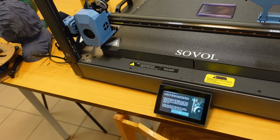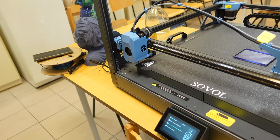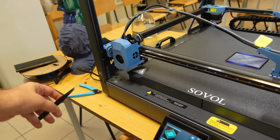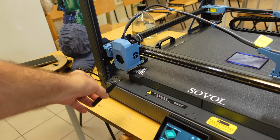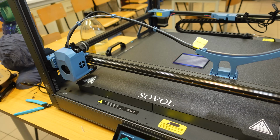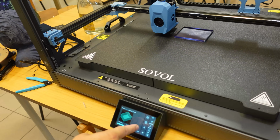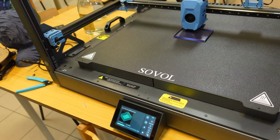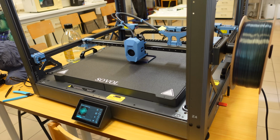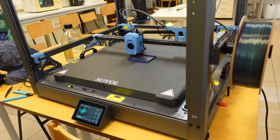Extrude. And I can see it on the other side. Now it's a good habit to pay attention to the nozzle, and if there is any filament from the oozing, remove it. Resume button was here only, it was out of the frame. The filament change was successful without any problems at approximately 5 mm height, so I will analyze it later, but I will let this box to be finished.